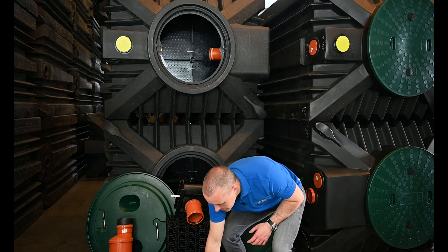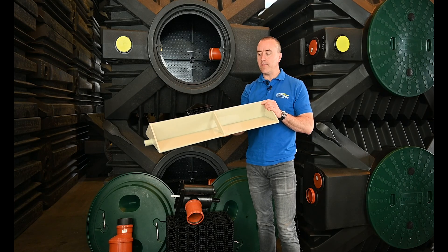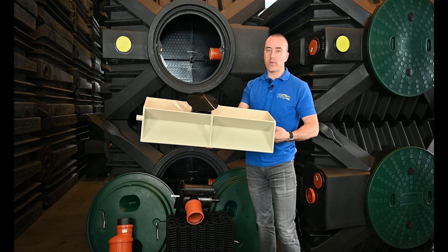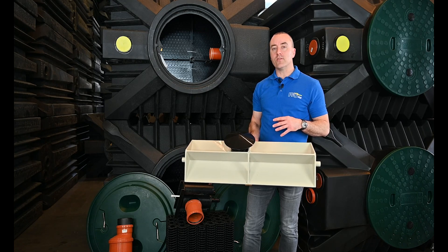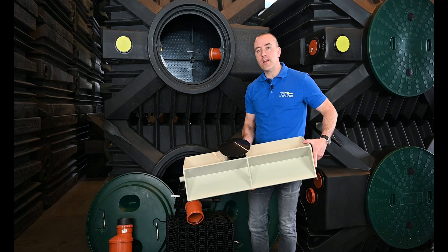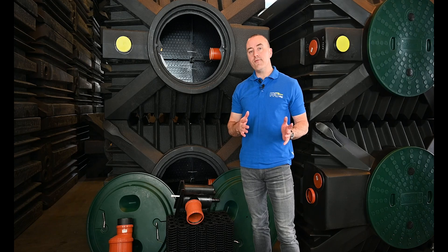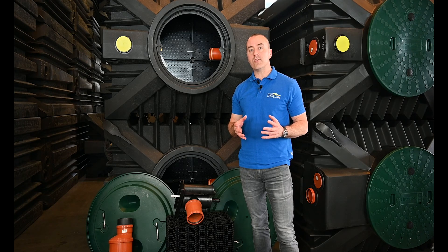I'm just going to bend down now and pick up the tipper tray. Within our bioreactor, the wastewater that flows in from the flow control device flows into the tipper tray. This is a vent attached to the tipper tray for delivery, but this is our tipper tray. Wastewater fills into one side, then when it gets heavy, it tips. Most of our partners are familiar with the tipper tray, but what this does is it allows the wastewater to be evenly distributed over the entire surface area of the bioreactor. There are a couple of other non-electric systems on the market that don't use a tipper tray — as a result, wastewater is not evenly distributed, the system becomes more loaded and you don't get a good cleaning standard. So as you can see, every step of the way with the ClearFox Nature, we have engineered really innovative yet simple solutions that enhance the system greatly compared to any competitor system on the market.